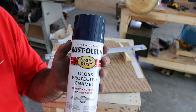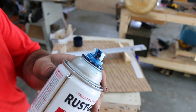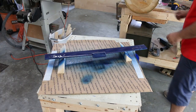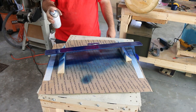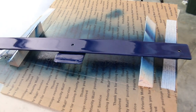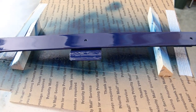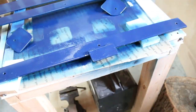The only reason I'm painting this blue is it's the only paint I have. The cap must have exploded or something, so I stole a cap from a different can — we're in business. Just when I thought the only problem was the cap, I realized I put the mount on the wrong side. The spacer should be on top, not on the bottom. So I cut it off and re-welded it onto the right side. This should be good now.